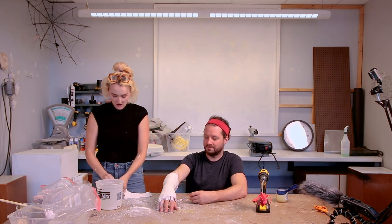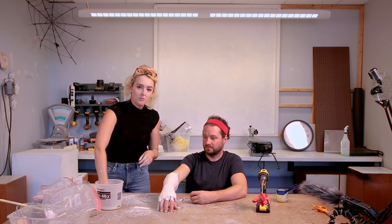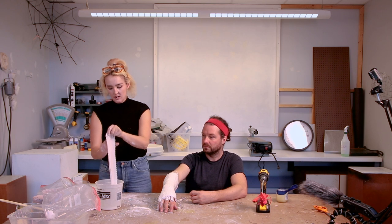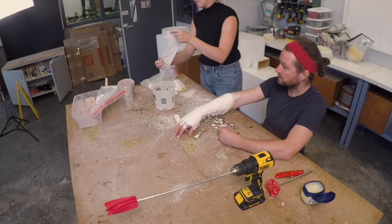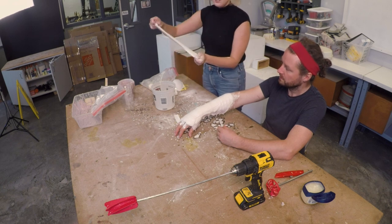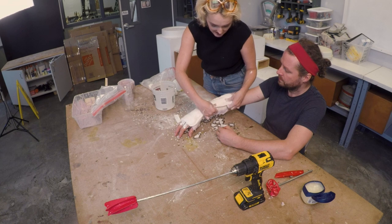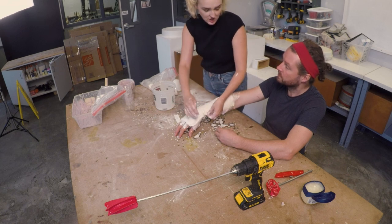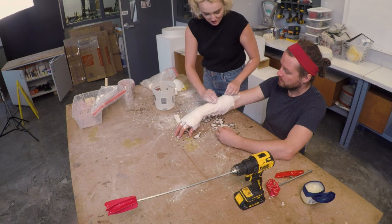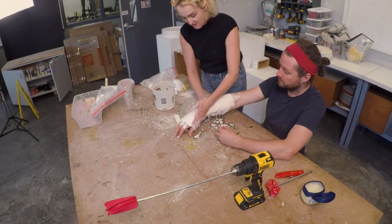One thing that I will tell you, I'm adding a couple of final pieces. That was feeling a little bit thin. As it was setting up, it still felt a little bit thin. You don't have to add a ton of material to increase a little bit of rigidity. You see, these are singular layers. These are kind of paper thin, but just inherently because it's going in an opposite direction and it's all one piece, that's adding an infinite amount of rigidity and strength to it, just because it's facing a different orientation. So a little bit goes a long way.